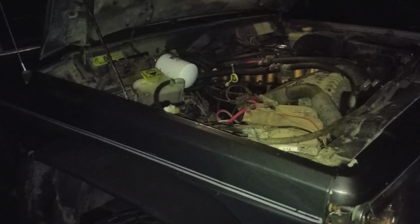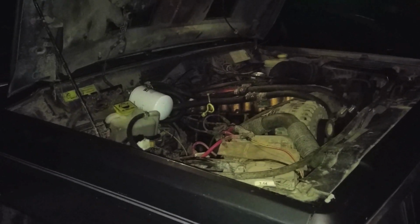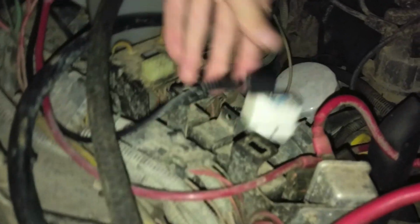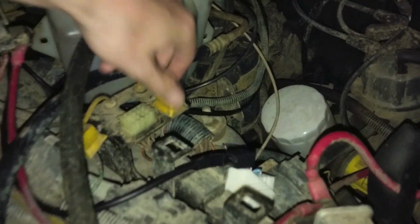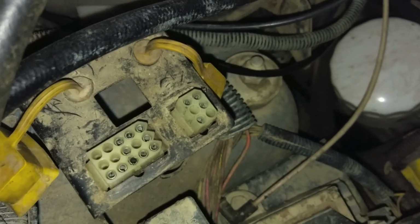So, you want to build your own, huh? You would like to look into the mind of your Renix era Jeep, see what's going on, or if you have a different version like some Volvos and Renaults and other strange, I think they're European cars. If you have yourselves a Renix, you'll be looking for this right over here. Generally, there might be a cover on this. On the Jeeps, there's like a big black cover here, but you'll see these two yellow things. So these are the pins you're after.